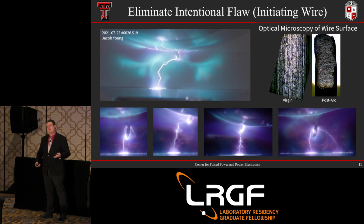Characteristically, in the description of anode-initiated flashover, what we're going to find is ideally we'd like to see some fractal-like tree growth, and then most of this structure is going to end up being etched into the top surface of the insulator, which is contrasted with cathode-initiated flashover, where you're not going to see much damage to the insulator in post.